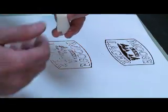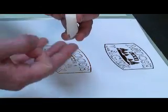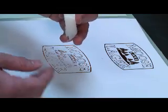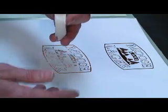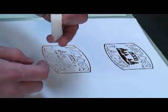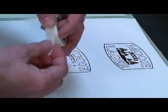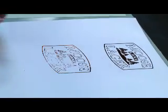But if you go up with too much spot make-ready tape, because this is offered in two other thicknesses, 3 thousandths and 6 thousandths, then it's possible that you could have built up too much and have to start your make-ready all over, because this is difficult to pull back off once you've already applied it. So now we're going to dampen this and put it on the areas which we've identified.